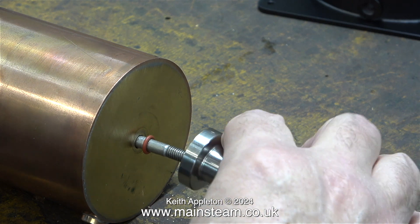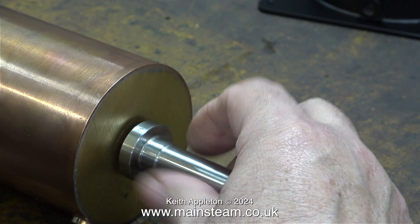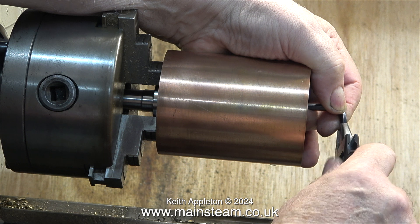The reason for this is twofold: the first being that I didn't have a short stainless steel allen cap head bolt, and the plain shank part of the bolt is much better for the o-ring seal.